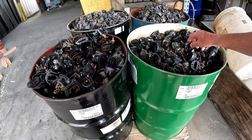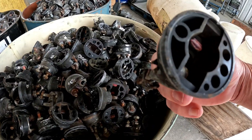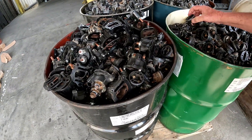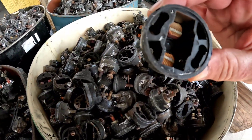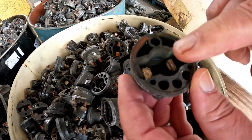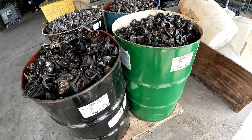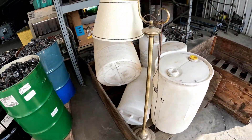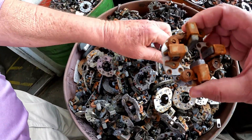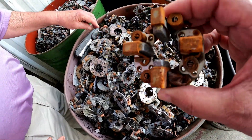Back to the solenoid — this is what you find when you get inside. It's burnt up. So we replace 100% of them. That one actually looks pretty good — I don't know why it's there — but you can see how much it's burnt. We replace brush springs and brushes 100%. All these brush blocks and springs and brushes all get replaced.